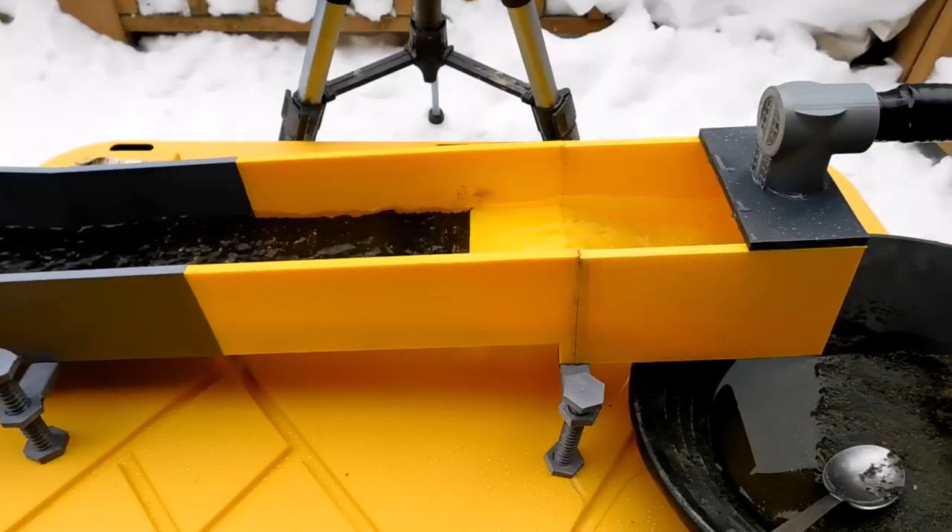I'm already seeing a little bit of gold. About half the material has run so far and I'm really happy. You can see there's gold at the top of the riffle — there's a little bit down here too. You can see the turbulence, but when you come down to the flare, look how that flattens out into that micro mat — that's working absolutely wonderful. This is really heavy garnet sand — this is some of that gold from Nome, off the beach, from that Wild Ranger material.